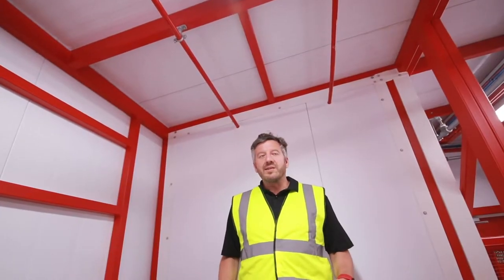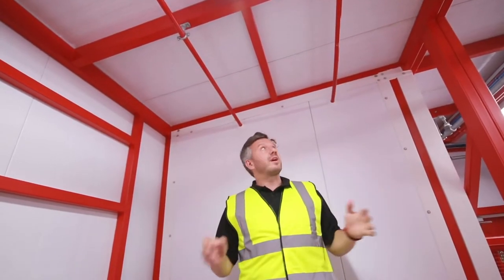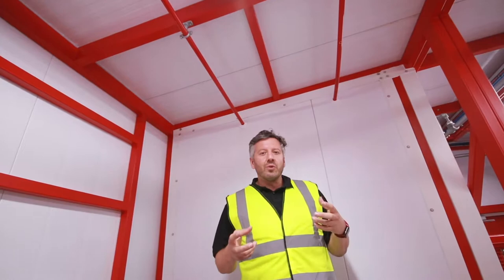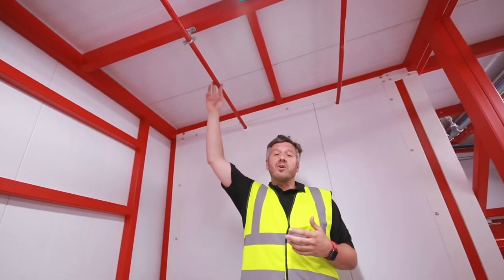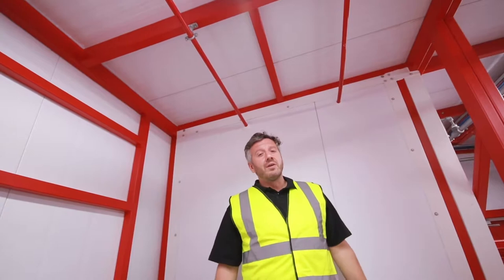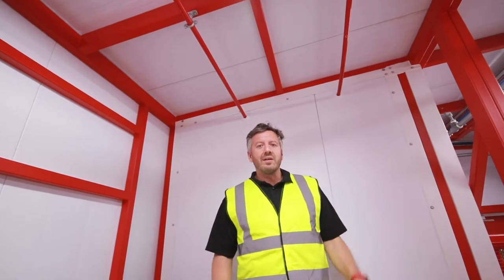The fire detection works in this unit by using a double VESDA system. We've got two sampling pipes that run through all the storage areas with a small sampling hole in the pipework, constantly drawing through air and sniffing for particles of smoke. On a detection, we get first knock from one pipeline, and then to eliminate false alarms, we rely on a second knock as well from the second pipeline. With both systems indicating a fire situation, that's when we'll go into alarm state and the fire suppression system